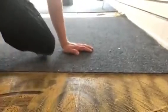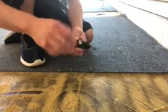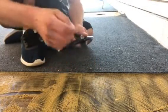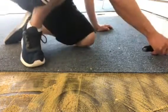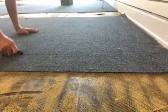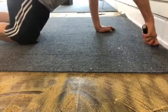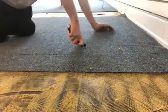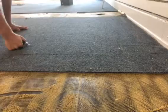We're on a small section here. Get your razor knife, and rather than trying to tackle a whole piece at a time, get a fresh blade. You've got to cut roughly six inches at a time. If you try to manhandle a whole piece at a time, you will burn yourself out and get nothing done. So it's actually more effective to just cut into little strips like this and tackle each little section as you go.